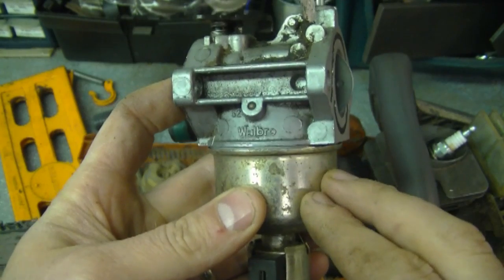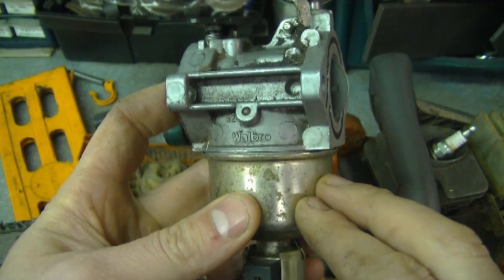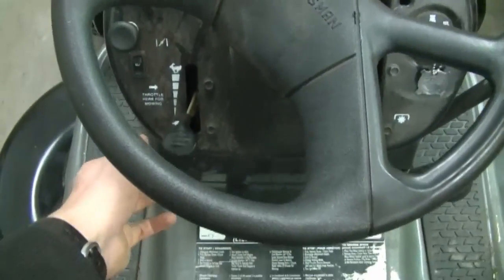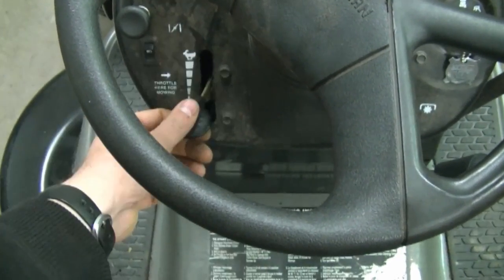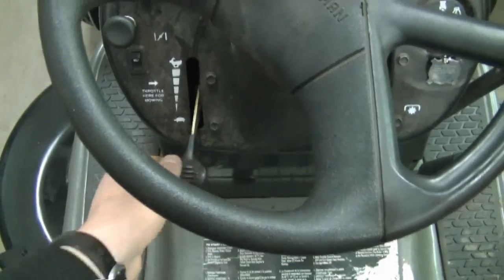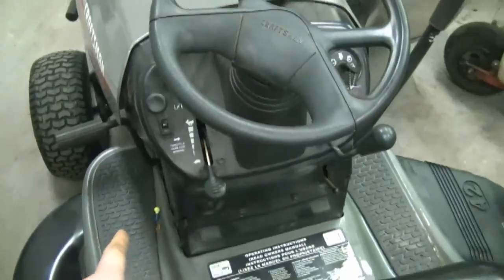You may not have a solenoid, but if the carburetor is set too rich, that can also cause a backfire on shutdown. Another reason is if the throttle is wide open when you turn the key off — always bring the throttle down first, then turn the key off. That should help prevent backfiring. If your tractor backfires excessively even after following these precautions, it could indicate deeper engine issues that need to be looked at by a mechanic.